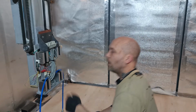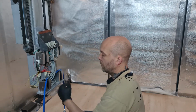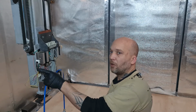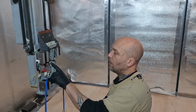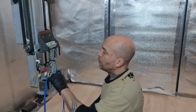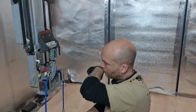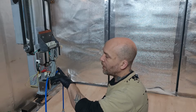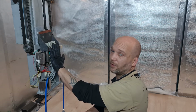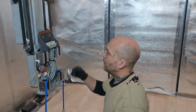Right, so behind here, I've got everything covered in dust. So MDF, dangerous stuff, annoying stuff. So behind here, I've got piezo hooked up, all connected to a Duet 3D tool board for a Duet 3. So that's my probing, and that's all linked in via CAN bus. And then the 24 volts that I apply comes up to this plug here. Obviously everything's disconnected, so I won't be touching it. It'll be safe.